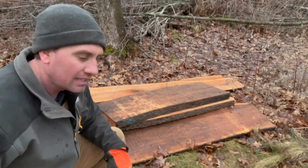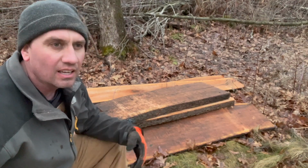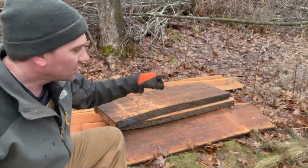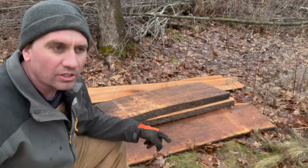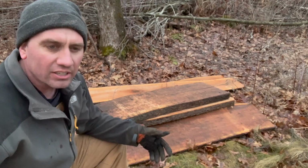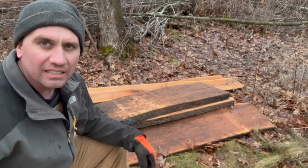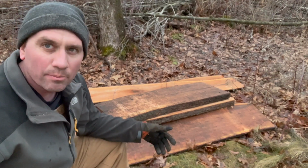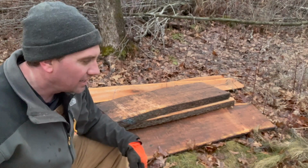I'm gonna clean these things up, get them stored away, probably treat the ends with something to try to prevent more splitting. You can see I already have some split started in some of these. That's one thing you realize when you start trying to make your own lumber: part of the cost in lumber is because you have to cut a lot more than you actually get because of all these splits and imperfections. If you're going to cut 10 boards, you're not going to get 10 perfect boards out of it. It's nature, right? Anyway,